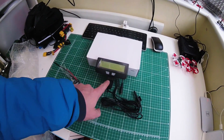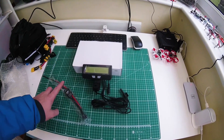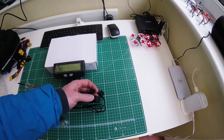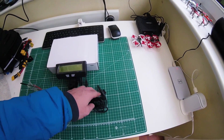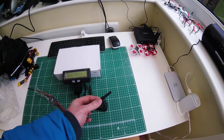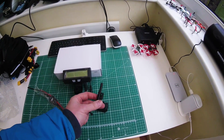In this video I'm going to explain how I fitted the standalone Cycle Analyst to my cheap e-bike. Many of the cheaper controllers don't have a Cycle Analyst direct connector, so you'll have to buy a shunt along with the Cycle Analyst. The direct connector which usually goes into the controller is connected to the shunt instead. You'll also need a Cycle Analyst version which has a speed sensor.